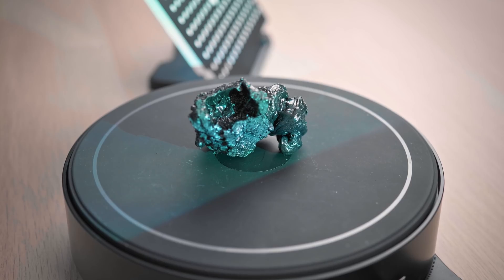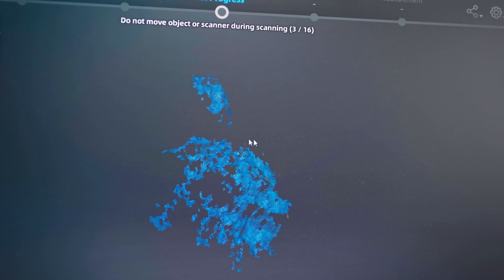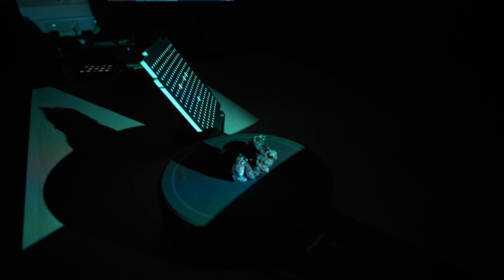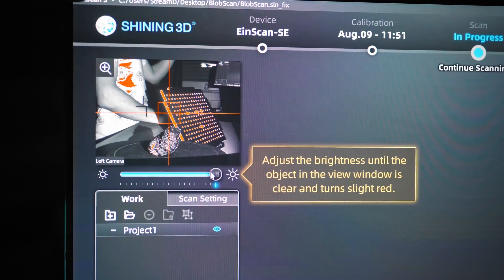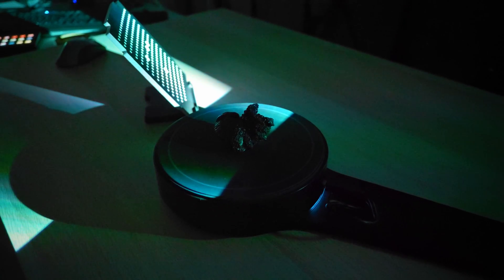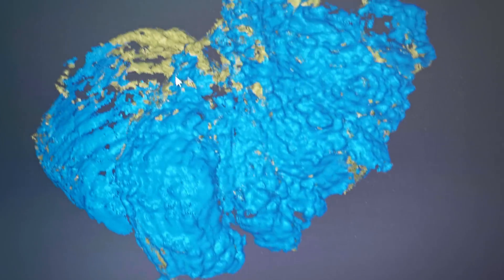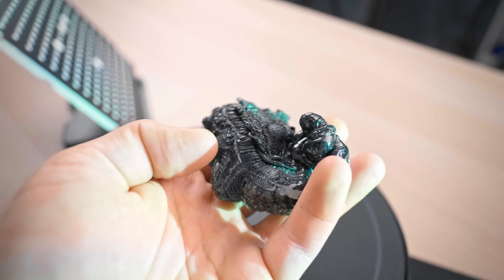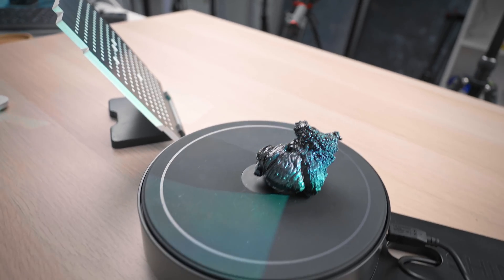You can see in real time how everything is being reconstructed, but it's not really picking up all that much. So I'm gonna quit this scan, turn off my studio lights so that the scanner's built-in light is illuminating the part a bit better, and bump up the brightness slider to the max. The first revolution is done and it is not looking too hot — a lot of texture is there, but there are big gaping holes simply because this is a black, glossy object.